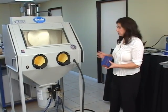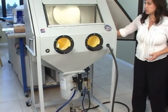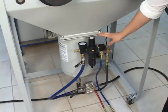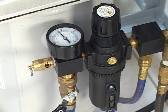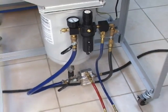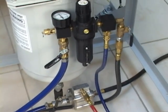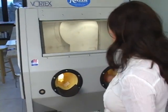Okay, so we're going to put the paver in our cabinet. This is our 2034 VX sand carving system. The cabinet has dual doors so you can enter through both sides — nice and easy. We also have our regulator right in front of the cabinet, and the pressure gauge is right up here so you can see your blasting pressure. To raise or lower it, simply turn this knob. Foot pedal is on/off. It comes on wheels so you can move it around easily. It comes as is, just a couple of quick connects to set up. Here's our padded armrest and I'm going to start blasting.